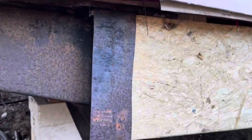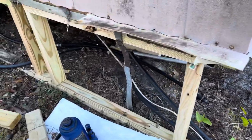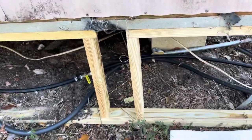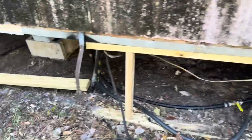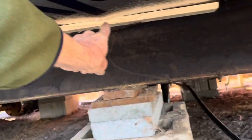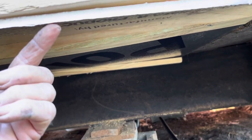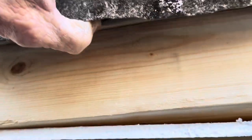What you're going to want to do is come out here on the outside. This is not permanent — we don't have it straight up and leveled out yet, we just have this in temporarily because we're working on that bedroom floor. The band has been replaced. Your house won't have the support mine has coming across this way, because your last two-by-six is back there and the next one is just hanging out here — you'll have a two-by-six just like the floor joists.